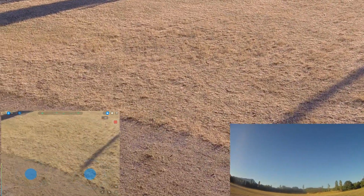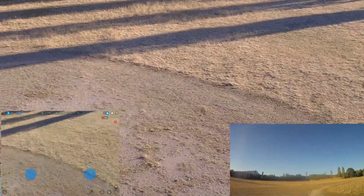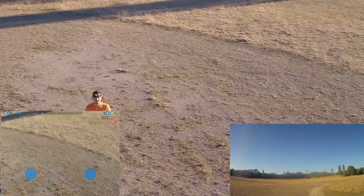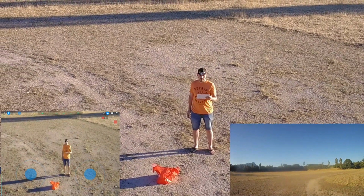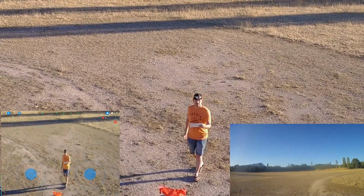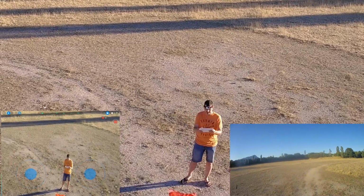Can you see me a little bit more like this? I should be around. Yes, as you can see, I'm here. Definitely the yaw command should be a little bit less, the rate a little bit more, less important, but it's stable. Look at that. For an electronic stabilization in wind-free conditions, it should give decent videos.